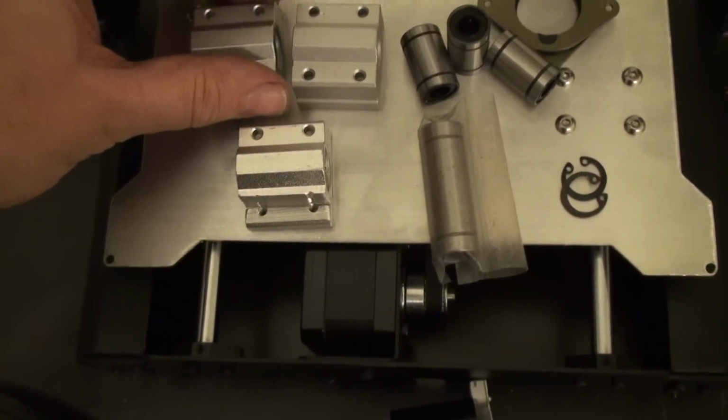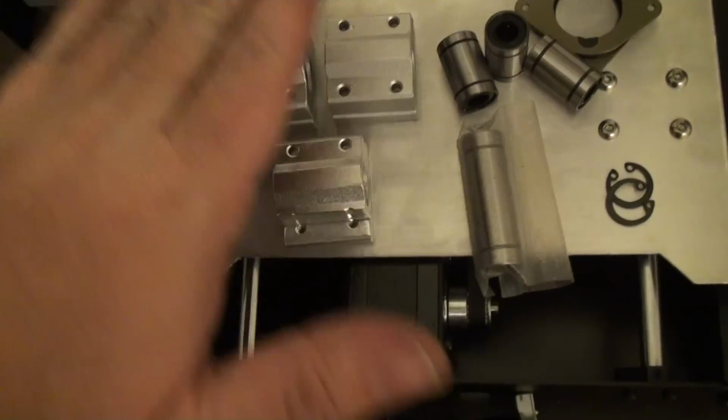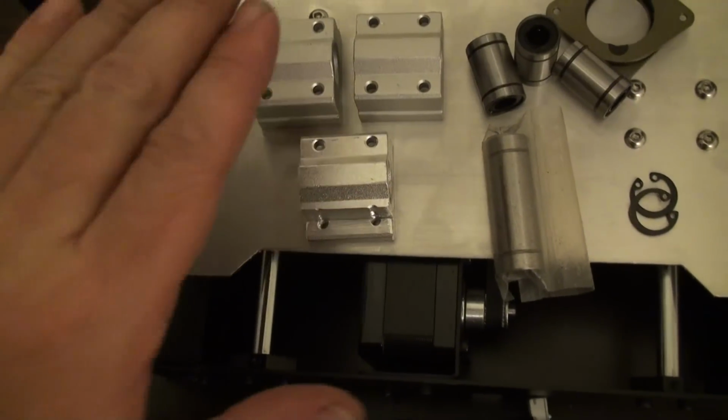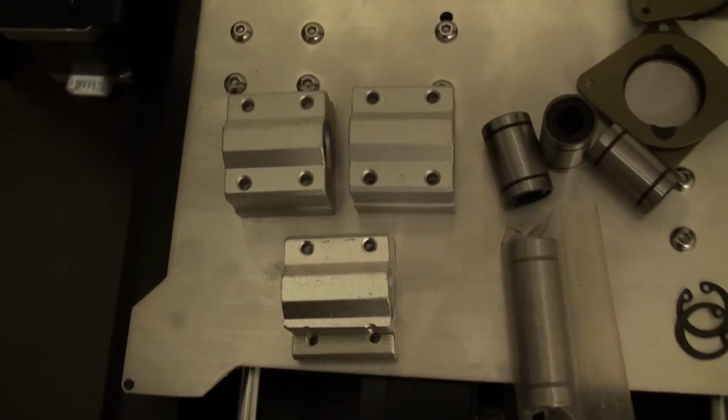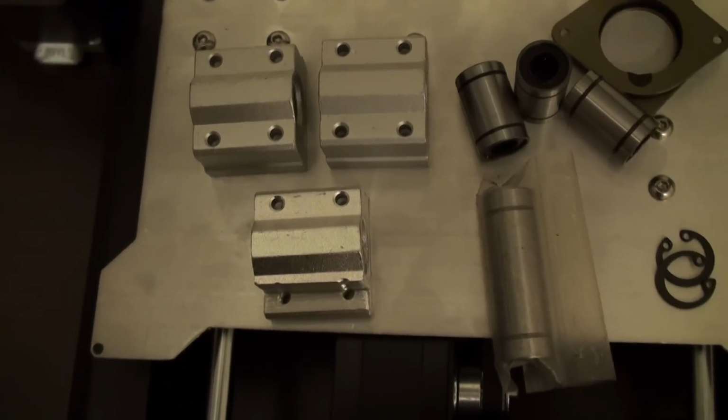The idea is that the double row top bearing prevents it from rocking, and the third bearing is just there to keep your tilt out of it, basically if you were looking at the axis. So you always try to do things in 3s.